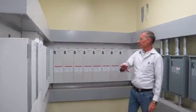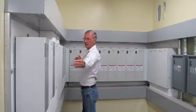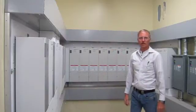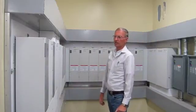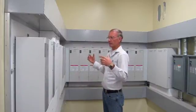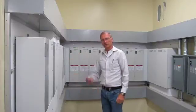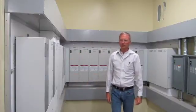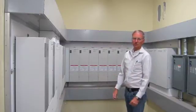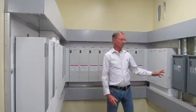This is the last of the three clusters of inverters — four 6,000 watt inverters tied together as a 24 kilowatt cluster. As I mentioned earlier, they're separated: this one runs the lighting in the house, the one on the other side of the wall runs outlets and heating, and the last one runs this mechanical room. Combined, they produce 66 kilowatts.